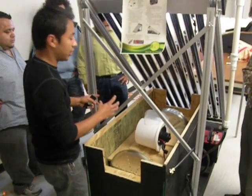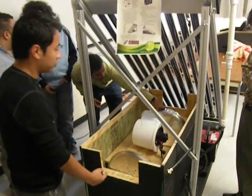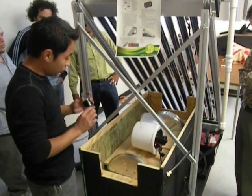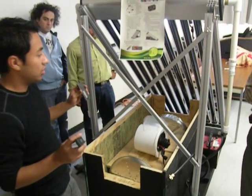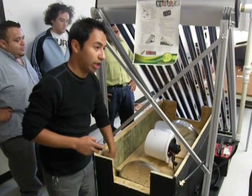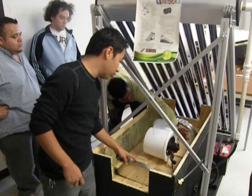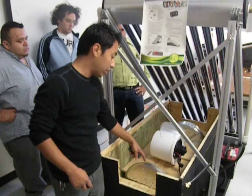We need to direct the hot air in there. This is where the intake is, and this is where the outtake — the outlet of the air — is. For testing, we use temperature hygrometers to check the humidity and temperature at the inlet and at the outlet. That's where you measure the humidity drop. And this here is the sensible heat transfer wheel.